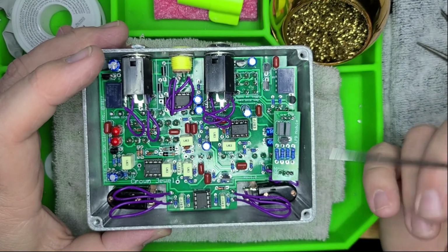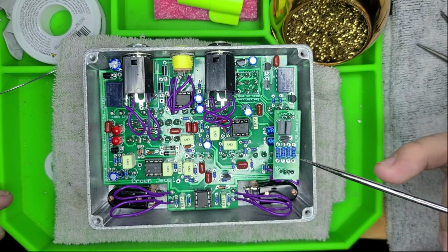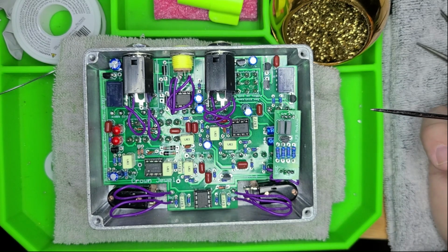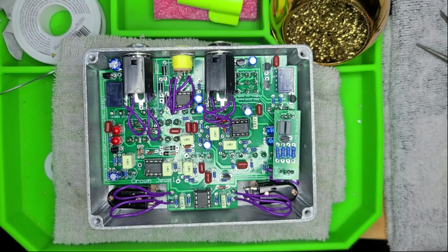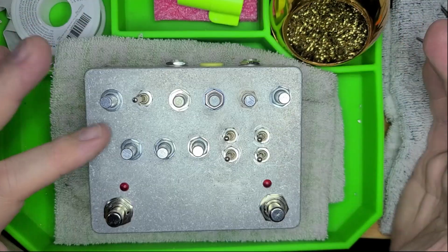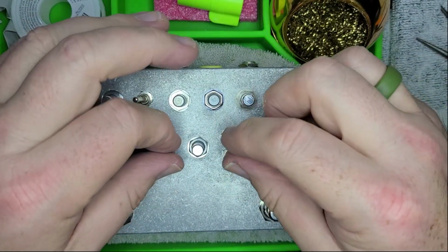As far as the instructions go, they didn't even have anything for the power booster or the linear power boost module. They didn't have anything. So the multimeter knocked those 4 resistors out to get the measurements, and then 1 transistor and 2 of the capacitors. And that's it. So in theory, she's done. I really hope she works. Tonight or tomorrow, deep dive into the tones of this bad boy, just like I did with the previous videos.